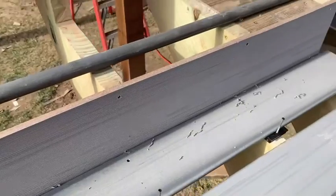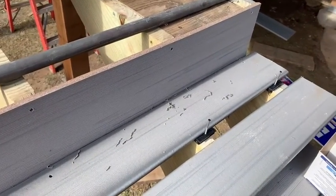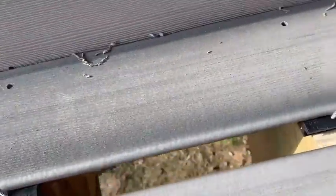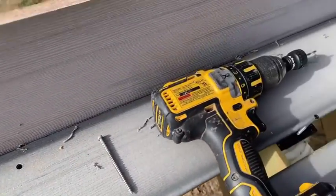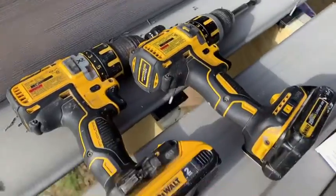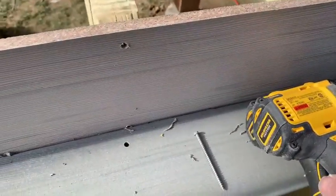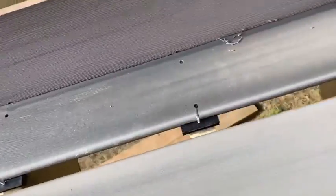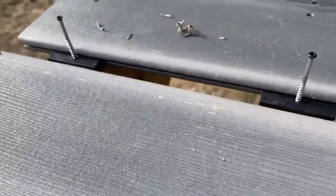All right. So, we're moving on down the line. We got our riser on, and we got our back portion of the tread on. So this and this for fastening, and then this for deepening the counterbore. We're talking an eighth of an inch. An eighth of an inch means success or failure. So anyway, we put the clips in the groove. You can see the groove. Now we're not going to screw those down yet.